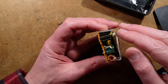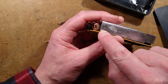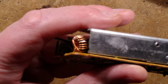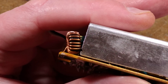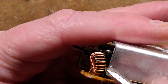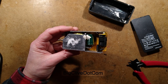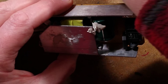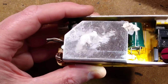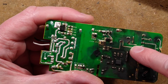Look at the way the heatsink comes down — is it clear? Look at this! There's a little skid mark right next to the inductor, but that transistor is plastic. There's a little metal tab just in here — can you see that? The little metal tab anchoring this heatsink down. And it's connected to this track, which is possibly the track that initiated this failure.